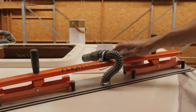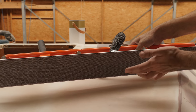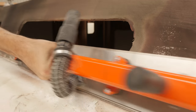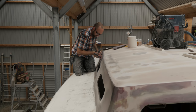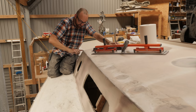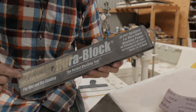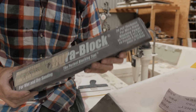For this most festive of occasions I'm going to be using the largest manual sanding board I've got from Flexi Sander — these things are freaking awesome. On here I've got this sanding net from Mirka. There are some areas where I can't use this big flexible sander from Flexi Sander — for instance here along this back edge, because if I use this I would simply just be rounding over this edge and I don't want that. Out comes Gloria. Gloria is apparently the name of my DuraBlock, and this was given to me by Cliff at the meetup in LA. Thank you so much Cliff, this thing is freaking awesome.